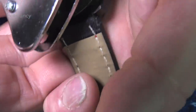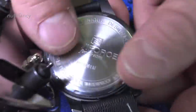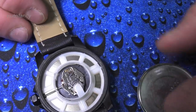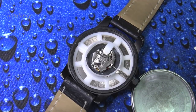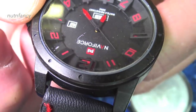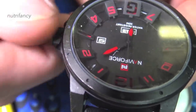I'm adjusting my watch tool to fit this case back. I used to be afraid to crack into watches, but as I did it more I got more confident. With a quartz watch it's simple — there's not much in there at all. Automatic watches are a lot more difficult. I'm setting my hands at the 6 o'clock position and will try to get the second hand at 12 o'clock. When I put the hands back on, I don't want to have to go through a timing process.